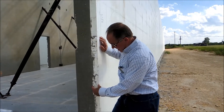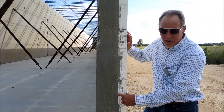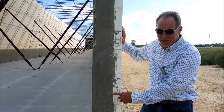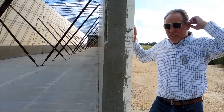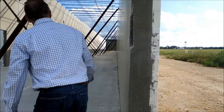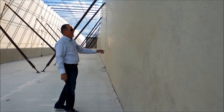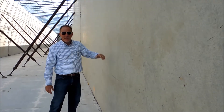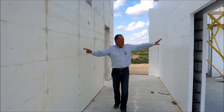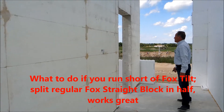Just like any other tilt-up job, you'll have the tilt-up panel, but in this case, when they tilted it up, it's got all the continuous insulation you need, plus the furring for the attachment of the interior and exterior finish. And in there, that's a 115-yard gun range, rifle range. So on the interior face, the tilt-up panel comes up, the temporary kickers go on, and away you go. These guys used the regular Fox Blocks and just cut them in half and used those for the underlayment of the tilt panel, which is pretty cool.